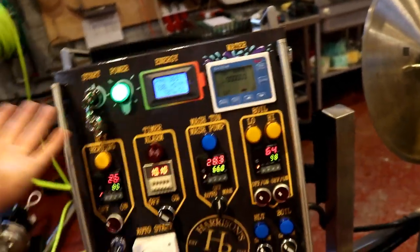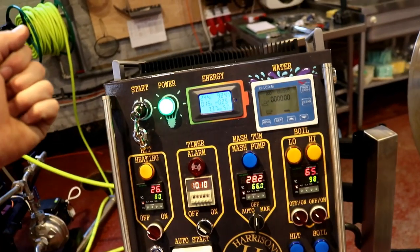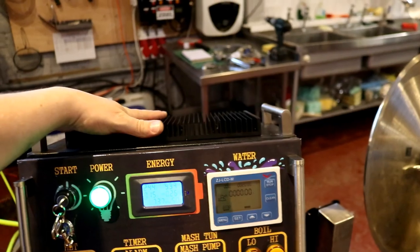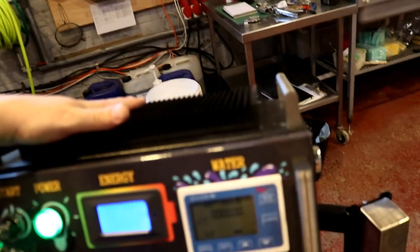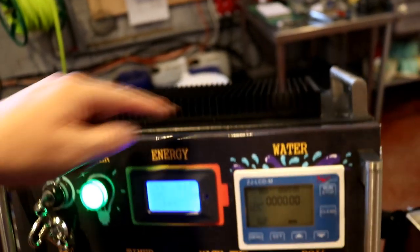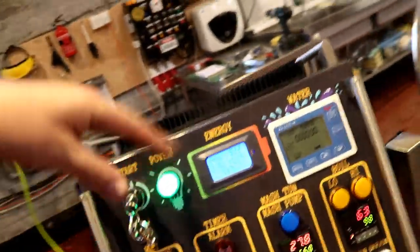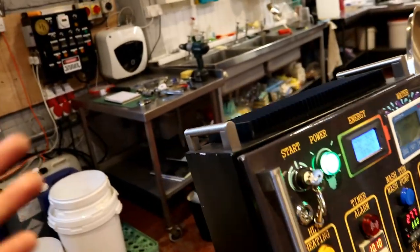The second gremlin: we installed a different coloured heatsink on the top. You can see this one is black and doesn't have bolts protruding through it, which looks a lot better. It has a thicker base so I've been able to tap the base and screw in the relays from the underside as I originally intended. I had to take the old one off, rejig it, and reinstall it — that took half a day in itself.